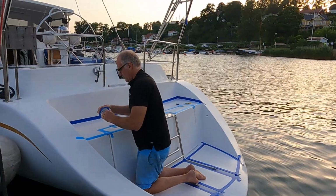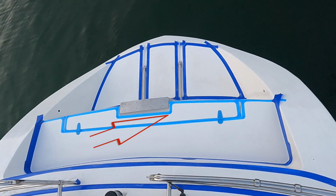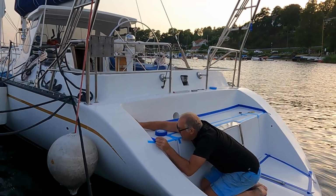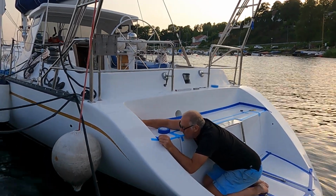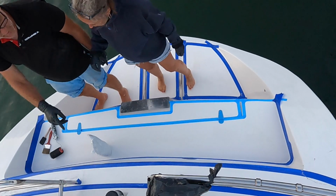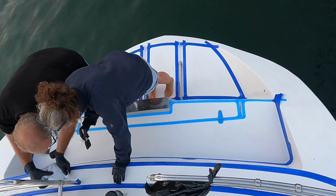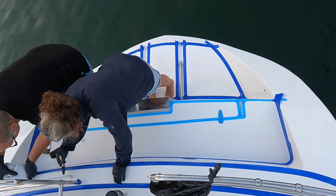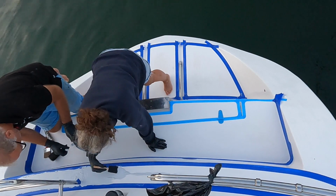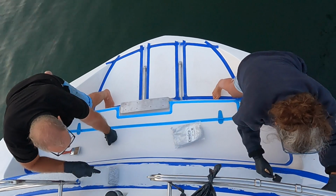Now it's time for the anti-slip paint. Lots of masking tape. We cut a small radius in the corners with a knife. After all the masking, we have a plan to paint the entire area in one step. Gray Kiwi Grip is our mission to roll so it looks smooth and still be anti-slip. This is our first time using this product and we think it was a success. Easy to apply it and to roll a pattern in it.